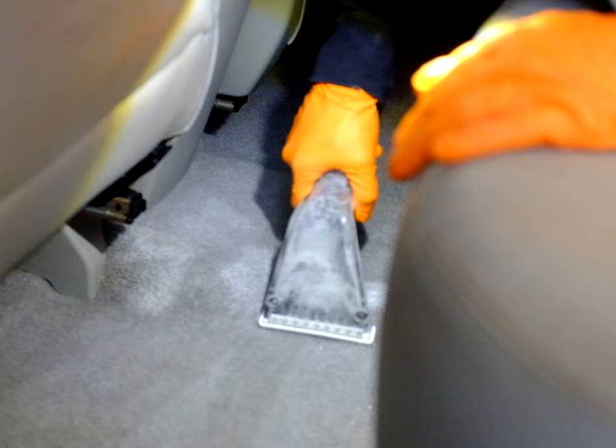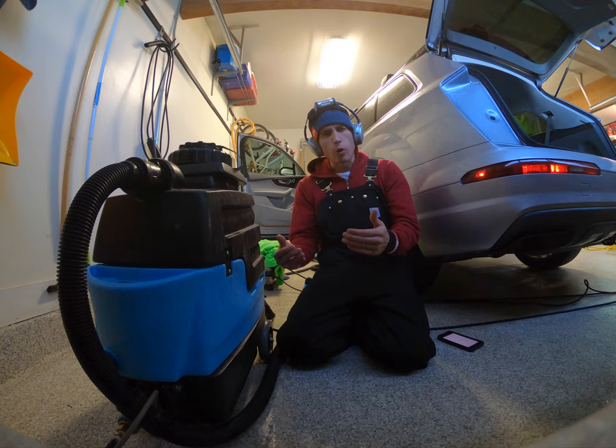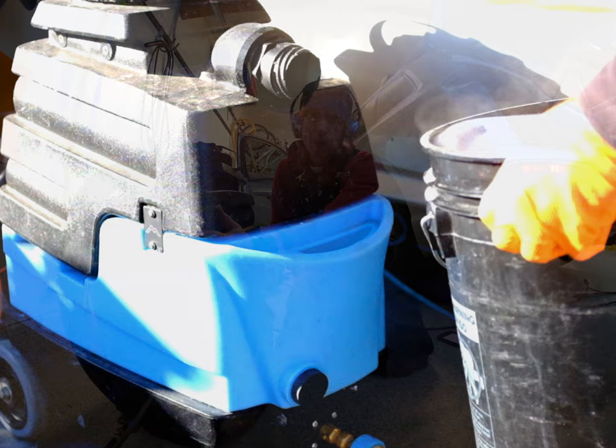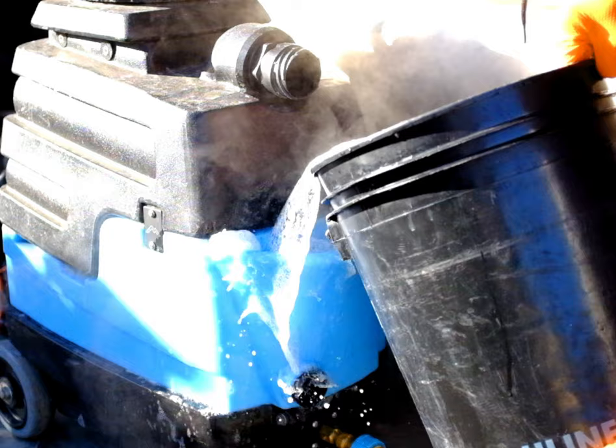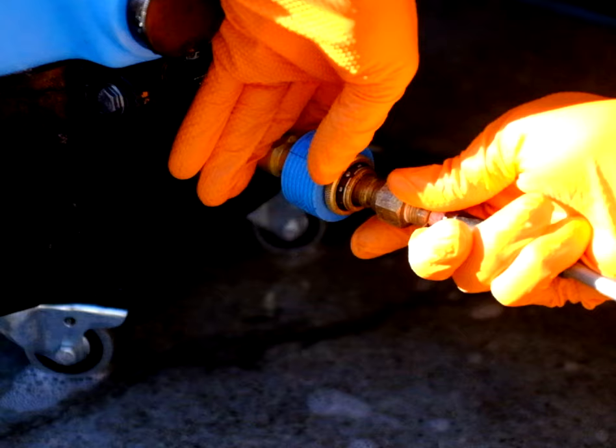I'm really into the carpet cleaning industry right now. You want to clean with a high pH, you want to rinse with something that has a lower pH, something that's more acidic. You put the hot water rinse, you mix it into your water basin here, and you are going to leave the carpets not only as clean as possible, but they're not going to re-soil as fast. This is simply the way to clean carpets.